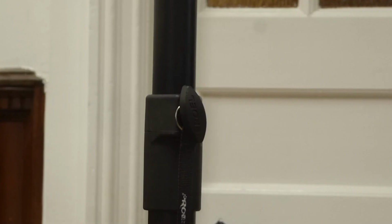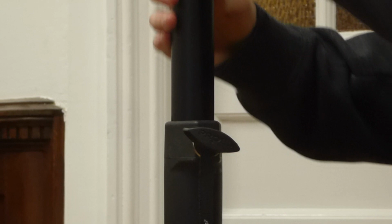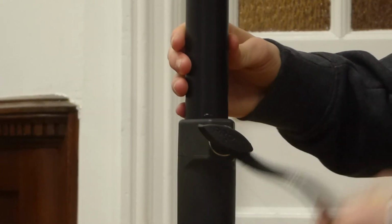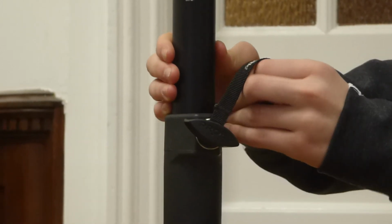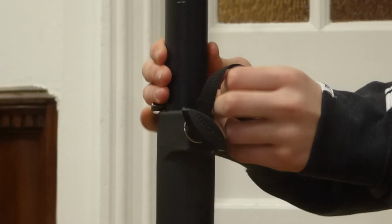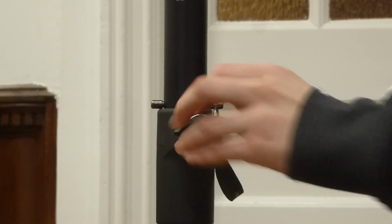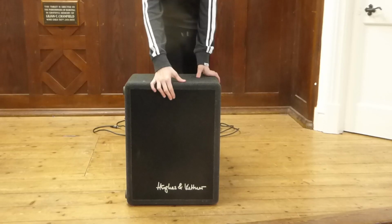Now loosen the top locking knob and lift up the telescopic height adjustment pole. It has 8 pairs of holes for setting at whatever height you want. Push the support pin through one of the pairs of holes to fix the height. You probably want to set it with about 5 holes showing above the base. Then tighten the locking knob. Again, it only needs to be finger tight.